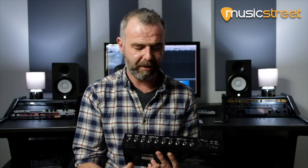Ins and outs on the back: volume control on a push-push button, so it's nicely recessed, keeps it out of the way, and saves you knocking it. Expression pedal one and two on a single jack, so you can have a volume pedal, a wah, and so on. Send and return for your effects loop — it's two mono or a stereo effects loop.